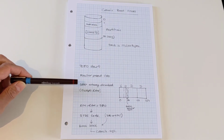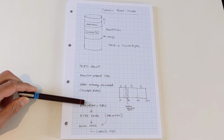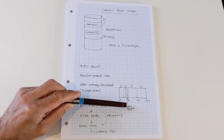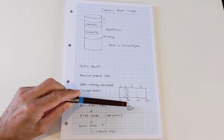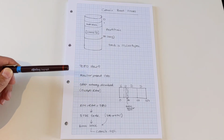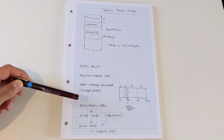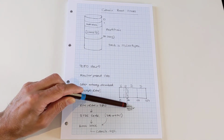The CPU jumps to C000, and at that point, the latest floppy disk ROM version, so I think that's version 3.1 something and above, they would know about the STDC hard disk controller. So at this point, the STDC is just sitting there. It's probably come alive, it's got its own firmware, and it's got its own ROM, so it started up. But the code to address it was stored inside the diskette controller.